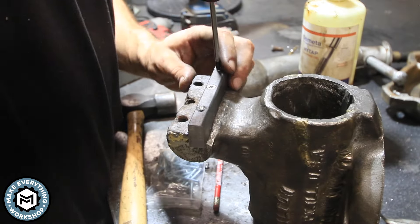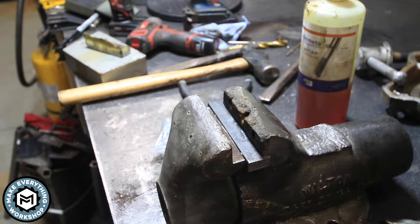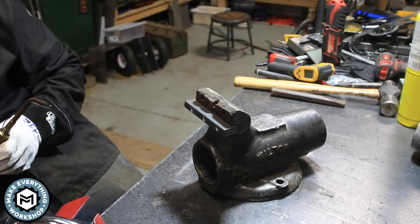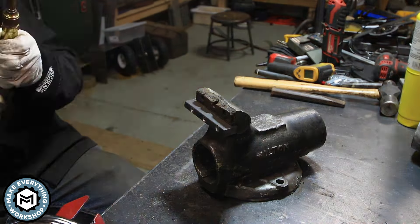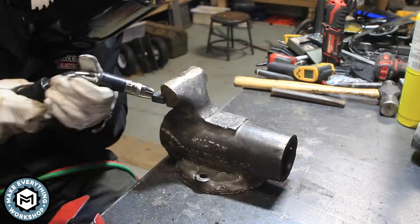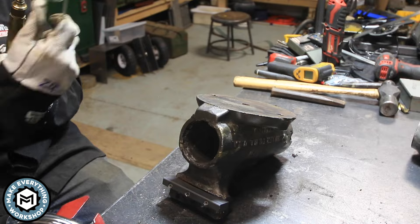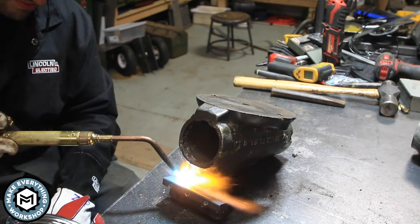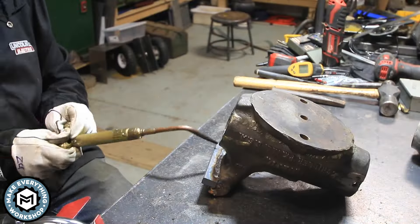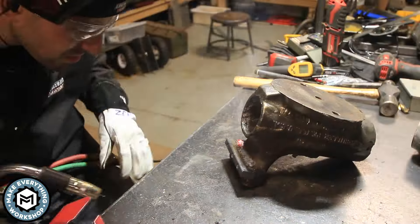You can see how nicely it looked when I just screwed that in with the fasteners. Then I went over and used the grinder to V-out some of the cast iron and a little bit of the steel to try and get a better weld. What I read online was that you need to preheat cast iron so the weld doesn't crack, so I used my oxyacetylene torch. All I had was a brazing tip, but I got this thing pretty hot. The first couple welds on the top side of the jaw were really just supposed to be tacks, but they honestly turned out terrible. After that I gave a little more time and care into heating the bottom section, focused my heat better, and made sure this thing got warm before I tacked and welded. I wound up setting my machine down a little so my welds penetrated a little bit less, but with the extra heat I didn't need as much voltage. I continued to heat and weld and build up those layers.